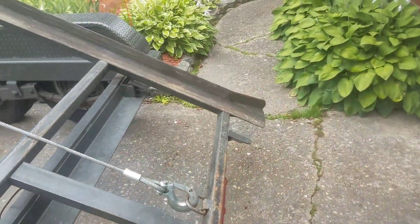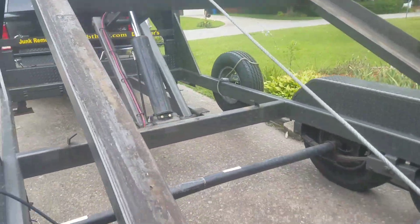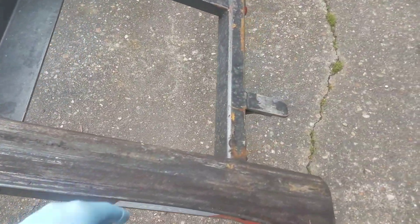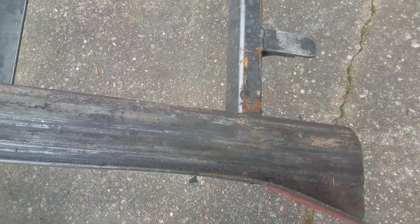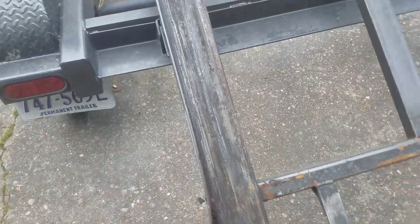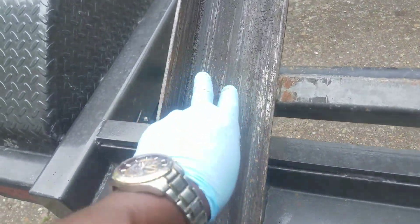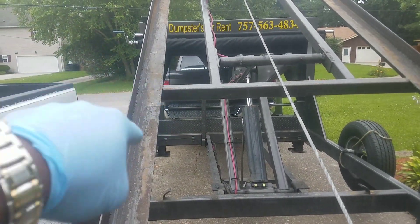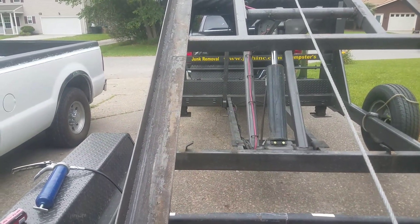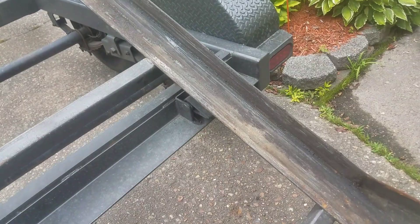Sorry about that, but I figured y'all want a little extra today. Those are the main grease points I find on this thing. Now I wish they would have put some rollers down in here so the back would slide better — you got that metal-on-metal sliding when the dumpster comes up on the trailer. So what I do is I grease this track on both sides all the way up into that T-bar right there — it really helps the dumpster slide a little better.